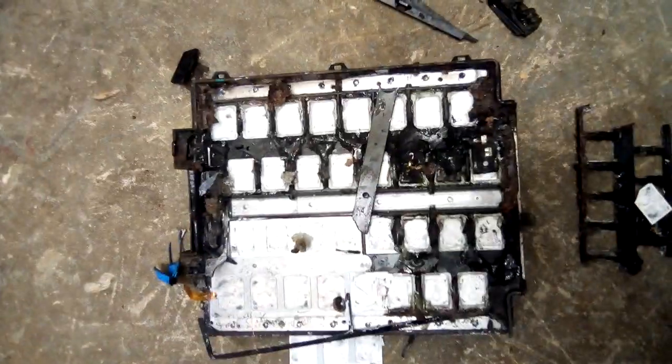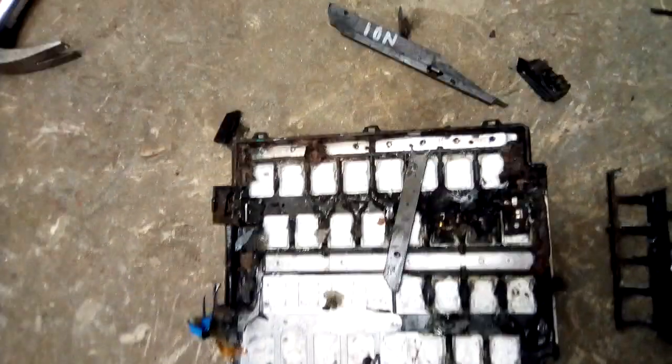Yeah, but I've got pretty much everything right down now, because the plastic form is off and the IGBTs themselves are off. You can't really remove them without destroying them, which is quite unfortunate. It means if you have a failure of any of the IGBTs, unless you're fortunate enough for them to be on the outside where you can replace them, the inside ones have no chance. I'm not seeing any way of accessing those other than by cutting open the tracks.